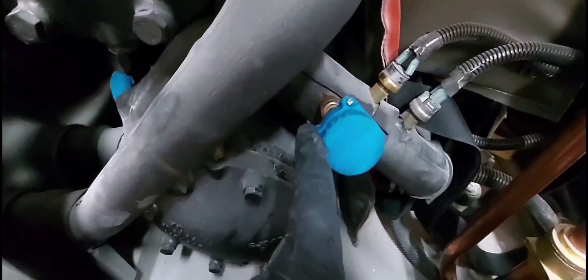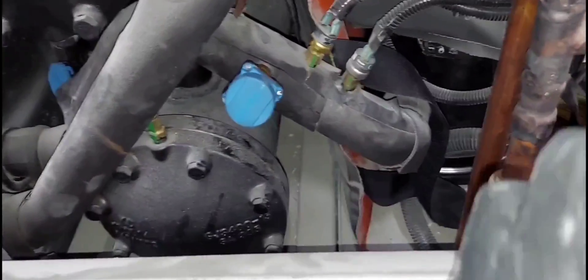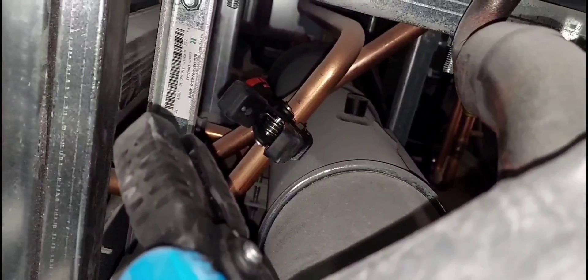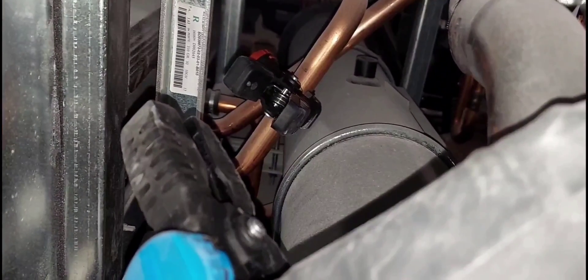Here's what I'm using: I'm using my Parker Smart Probes. I've got the low side here, low side pressure here. I'm going to do it once more, so take two — you guys have two takes of this system here. I'm using the Parker Smart Probes: low side, suction line, low side temperature. And you can see I'm on my liquid line over there — that's the high side liquid line over there. And high side right here.